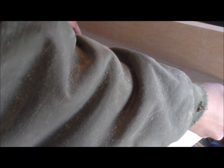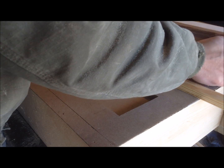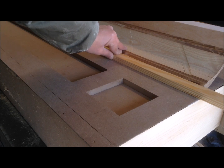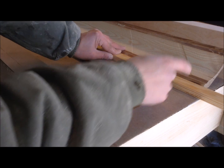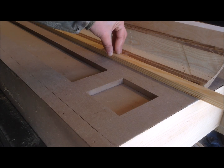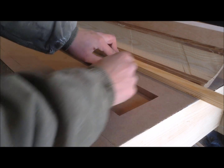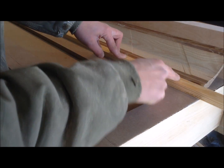So I put this on its back and place that piece of trim where it's going to go, and then tested out my crown molding. And you can see that everything lines up pretty much perfectly. So what I'm going to do is cut and final set these rectangular pieces of molding around the front and the edges on miters on the corner, and then especially up top. That will help me with setting my crown, because instead of trying to hold it in place, the molding will hold it in place for me and I can make all my marks.